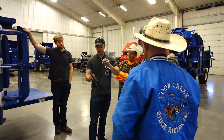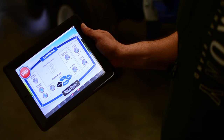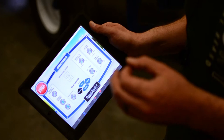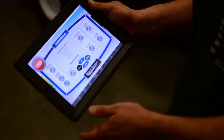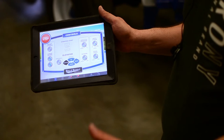The manual controls from the cab are intentionally limited. We allow you to move your vertical plunger up but not down, and we don't allow you to open it. That way you can't screw anything up — it just won't let you do the wrong thing. There are safety issues, and we've limited what you can do so you're not trying to run a vertical plunger into your horizontal plunger.